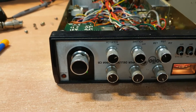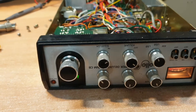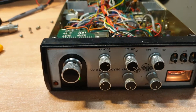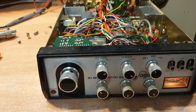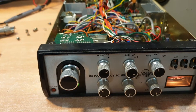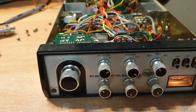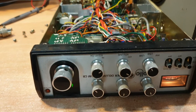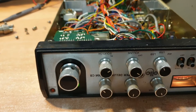There were some other things too — we aligned the receiver, which was miles out. The thing about that is when people go looking for faults, sometimes they'll head off in the wrong direction. This is where I tend to suggest: don't twiddle too much. If it's obvious a slug's been played with or broken, sure, have a look in that area, but don't twiddle everything alongside it — you'll just cause more problems without finding the root cause.